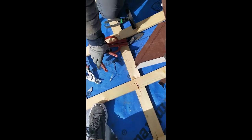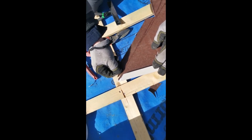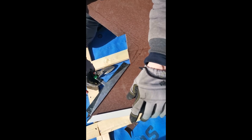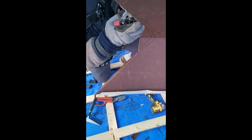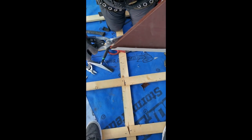Now to make the folds better, I have a small trick, you make a little notch on your line, so it guarantees that the fold is going to happen at this point and it doesn't accidentally shift. So we do it 90 down, same idea over here. Now in our particular case I don't need them to be that tall. Trim it.